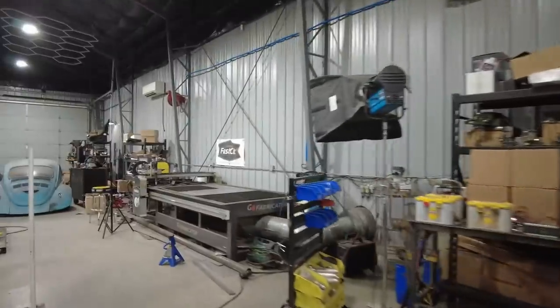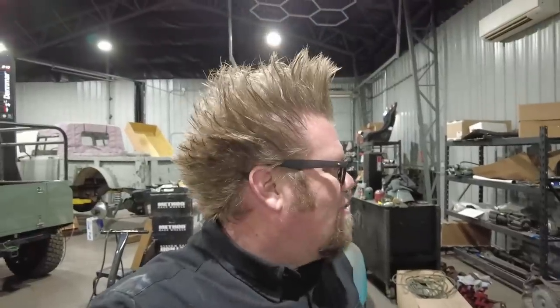And now all I got to do is basically get out a chunk of aluminum and chop it out. I lucked out a long time ago. I bought a whole bunch of sheets of aluminum, just stocking up the shop, and I never sheared them off. Normally I shear everything at 4 feet, but that skin's longer than 4 feet, almost 50 inches total. So I should be able to get both skins out of one 4x8 sheet. I just got to get the sheet out from behind the toolbox and get it onto the table.